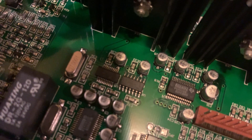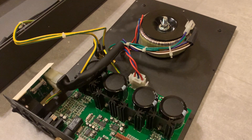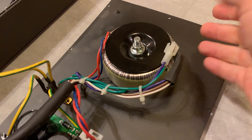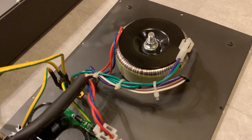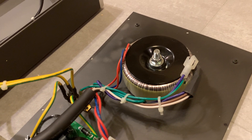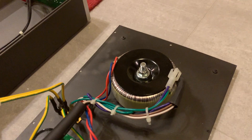There's a lot more that can be done, but right now this is just to document the insides as they look before I touch anything. The other thing I'll do is get rid of this metal plate and metal screw holding the transformer down, and use something non-magnetic — wooden shims — to hold it, so that the mechanical resonances of the transformer are not transmitted to the chassis, providing better mechanical damping and isolation.